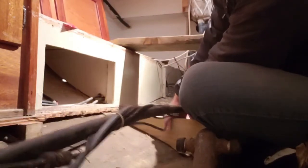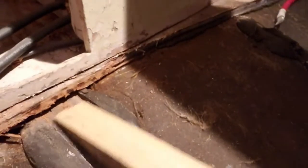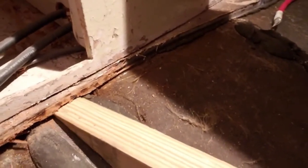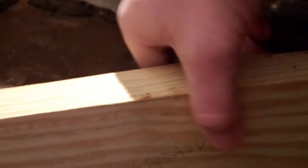Starboard fits — not bad. I do have some space down here and up here which I'll fill in with some shims. I've got a pretty good fit along the hull with a little bit of room here. The shims will bring it up level, but I can work with this. It doesn't have to be absolutely perfect because it's going to get glassed in.